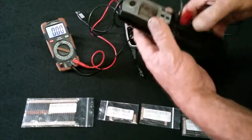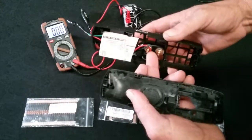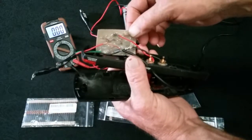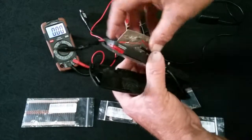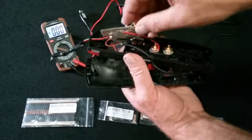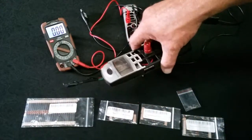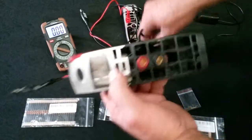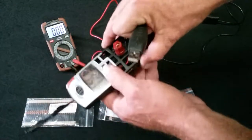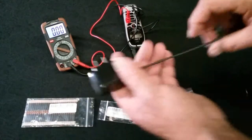I used old cordless phones — the wireless chargeable type — stripped the guts out, and hooked my two banana plugs off the board, which has the resistors soldered on it. My wires come out to my hall sensor through the end of the phone. The board is soldered to the banana plugs, and the power is soldered to the board. I put the back on and it's pretty handy. You can use a USB right out of a computer, or I like using a phone charger — five DC volts is what you need.